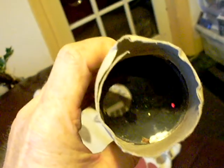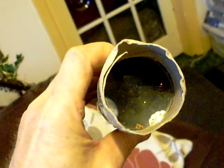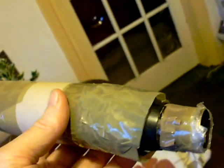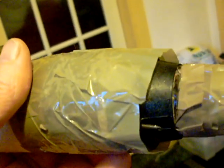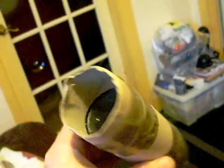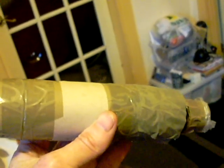Here's the simplest scope I ever made. I found this in a car boot, and it's probably got a diameter of about 40 millimeters. And it was used for something like a projector lens, and an old eyepiece. And I didn't have a prism for this one, so basically all I did was put the eyepiece on the front, I shielded it with a bit of cardboard, that stopped the glare and reflections from coming in. And then at the back of it, I used an old binocular piece of plastic tubing from inside a binocular where the lenses are fitting at the front, put the lens straight through the back, and there I have a small scope, and it's a rich field scope, and it gives incredibly sharp images. They're upside down, but then mostly for astronomy that's what you're working with, upside down.